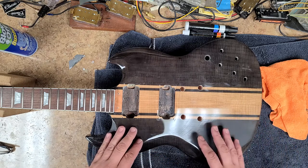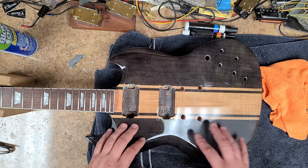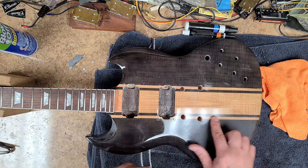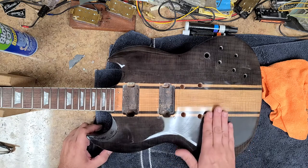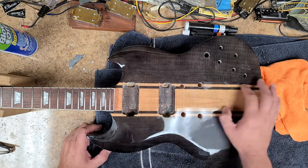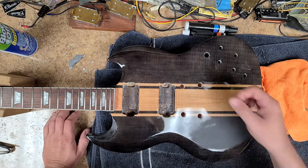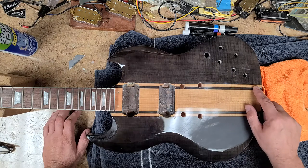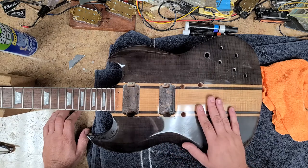Now, if I go through this and this has a sanding sealer or some type of a wood sealer on it before they applied the finish, they could probably have masked this off somehow and did a spray-on dye on the wood, and then cleared over that when it dried, peeled off the mask over this and over this. But with wood and water, it kind of absorbs, so you see a lot of fuzzy bleeding through around these sharp edges here. So I don't know exactly how they did this, but I like it. It's pretty cool. It's very interesting.